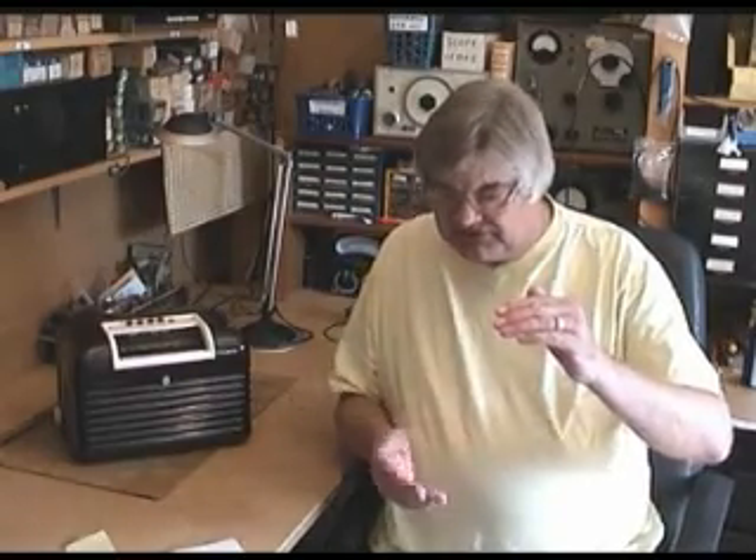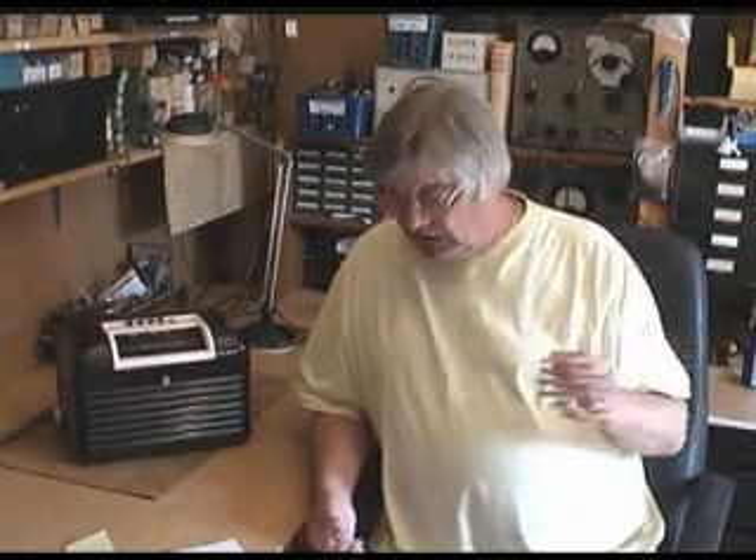That sounds odd. What we're trying to do is produce a third frequency. We've got 3 MHz coming in — that's the radio station you're listening to. We're going to mix that with our local oscillator signal, which is on 2 MHz. What is the difference between the two? 3 MHz, 2 MHz — it's 1 MHz. That 1 MHz comes out of the mixer and that is our IF, or intermediate frequency. It's still the radio station, still an RF signal, amplitude modulated. All we've done is change the frequency of the radio station coming in down the aerial from 3 MHz to 1 MHz, by mixing the 3 MHz signal with our 2 MHz oscillator signal. The difference is 1 MHz.